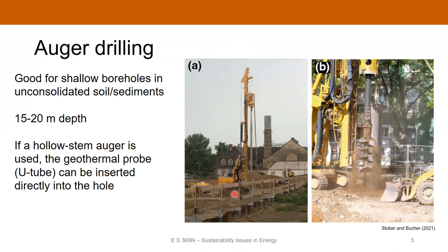The way it works is you've got a little skid with the auger mounted on a tower. The auger itself can't be much longer than about 20 meters. It's just a giant screw. You may have seen these at construction sites — they're often used for boring holes for pilings or foundations. You basically just screw that auger down into the ground.